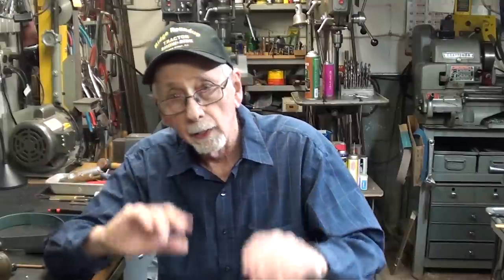There's also a fabulous full-size John Deere 730 diesel — that's a two-cylinder cutaway. There are other people hanging around so the footage isn't real good, but whoever did this did a fantastic job. Take special note of the pony motor, because this is a diesel engine that did not use an electric starter — it used a gasoline starter. All of those parts are cut away, including the hydraulics.